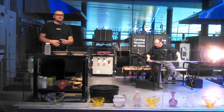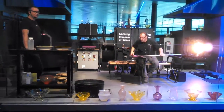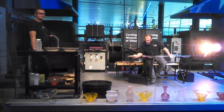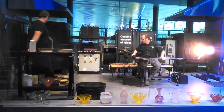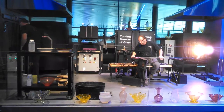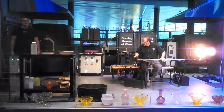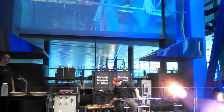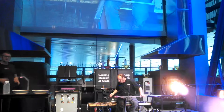He's going to cool this down a little bit and then go back in the furnace and collect about three times as much glass right over top of this. This is just a little compressed air to speed the process up by cooling it down a little faster. This will go back into the furnace and on this next gather you'll see he'll have quite a lot more — he's got more surface area, so he'll be able to wind on quite a bit more.